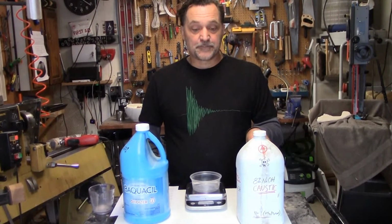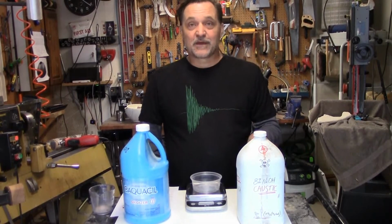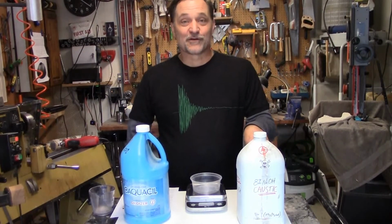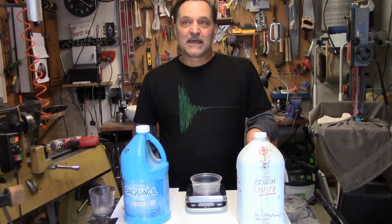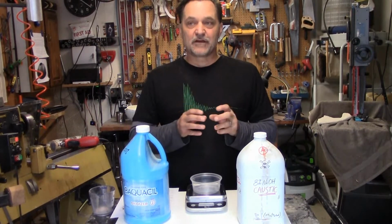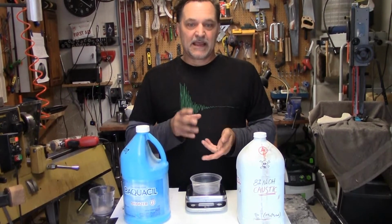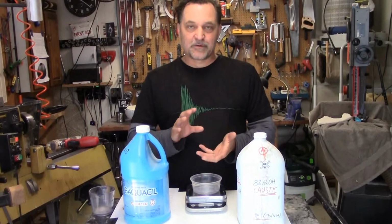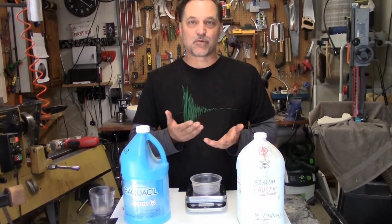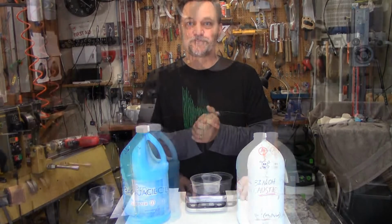And the other thing you can do that I really like, and that I got from Kevin Jasequel, another member of the club, is after you've bleached it, if you have a Beall buffing system, use the white diamond only and polish it with that, or buff it with that, and it just turns out like porcelain. So that's how you bleach.